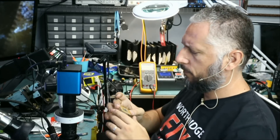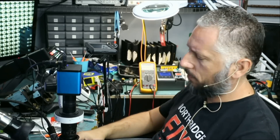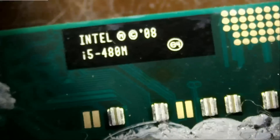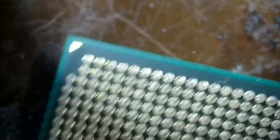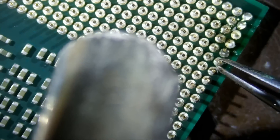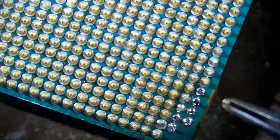Let's take a look. Right there — look at this one. I used pins from this CPU. It's an older one — an Intel i5. Since I used pins from this CPU before to fix AMD CPUs, I'm going to assume that this one has the same pin size. Let's use our hot air station — I have airspeed on low. We do not want to disturb other pins on the CPU. Let's take out the donor, bring the customer's CPU, and let's do it.